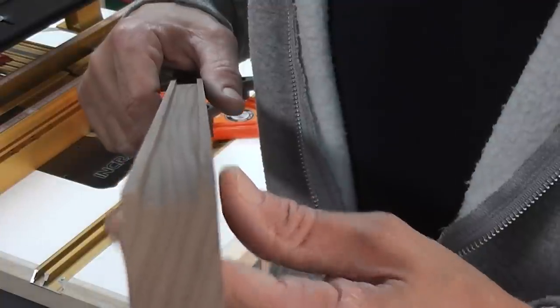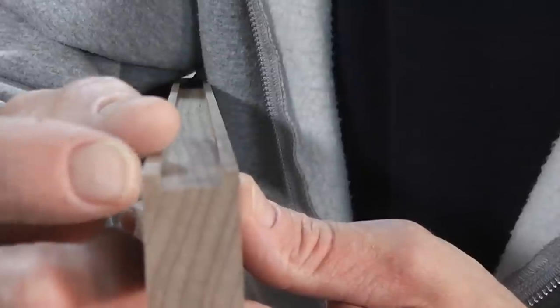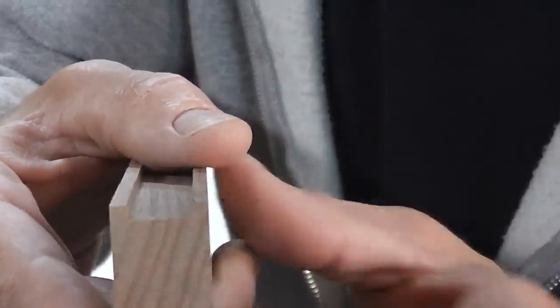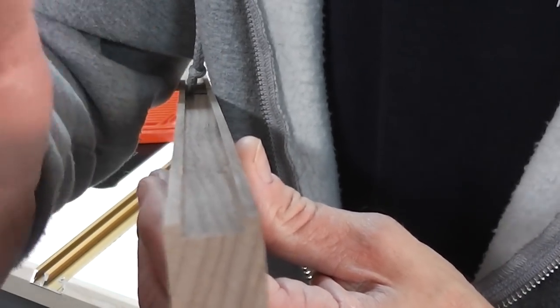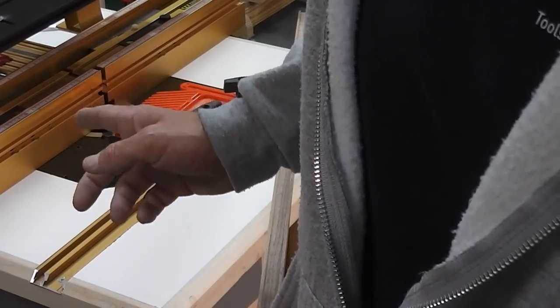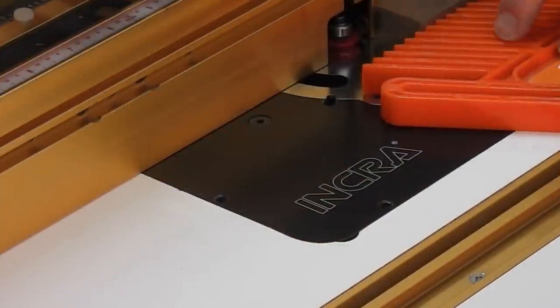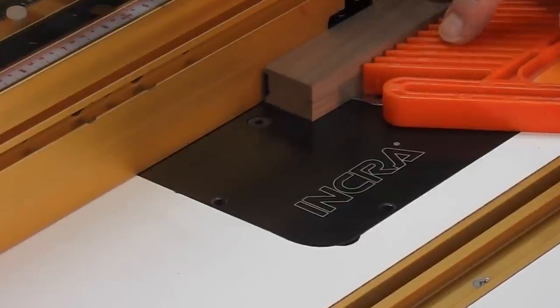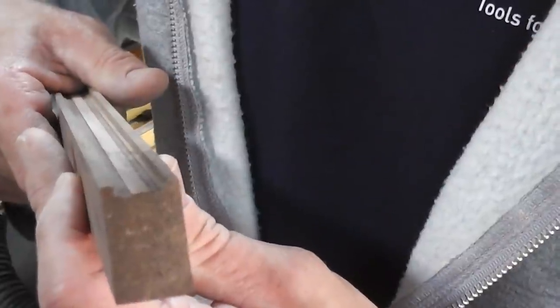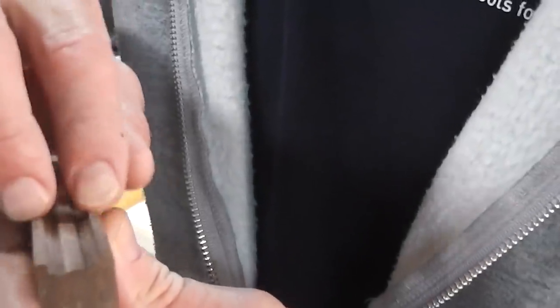So this is the profile I'm looking for. I've got a nice groove going down the center of it with an eighth inch on each side. What I'm going to do now is take the router and put a round-over on both edges. I could do it with a hand plane, but I'm going to use a router table because I want a nice, even round-over all the way along. I've got a one-eighth inch beading bit set up on my router table and I'm going to pass these through. That's the profile I'm looking for — a nice, gentle round-over. I use a router table to get consistent results along the length of the piece. I just need to do the other three now.